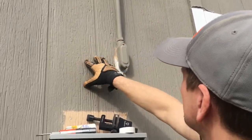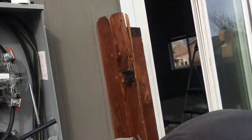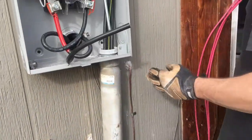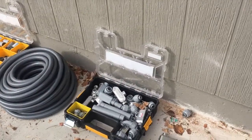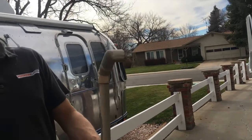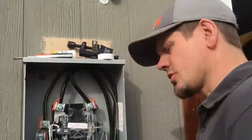I'll show you that inside later. This is the new oven they did — they piped that a few years back. And this is the AC unit. The HVAC guys only seem to carry red and don't care about phasing much, but I phased it. We're going to flex that with some three-quarter inch flex — it's Carflex PVC non-metallic right there. We'll probably drill it in about right here and come up in the bottom of the panel. That was an old PVC conduit which looked fairly hideous — most of it is hideous because they used some plumbing fittings, which are white. I've never had an inspector allow me to pass that. Anyway guys, that's part one of the video and I'll come back and show you the next part. Thanks.